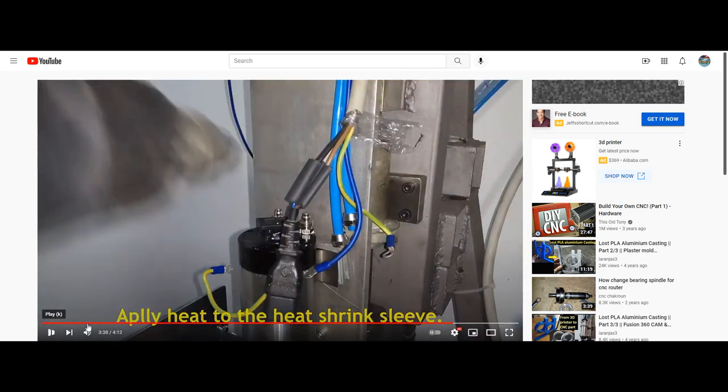And once again, we can see here, he took a power cord and pieced the power cord end into his spindle cable. We see shielding here that's exposed. And I cannot emphasize enough how dangerous this is. I see this in a lot of videos where the shielding is exposed from the casing insulation. Guys, if this ever makes contact in one way, shape, or form with any of those power leads, you're in a dead short. And again, sparks are the least of your concern. Okay?